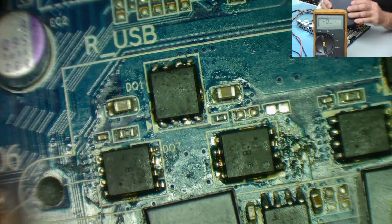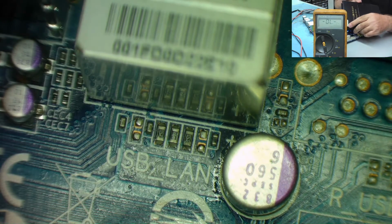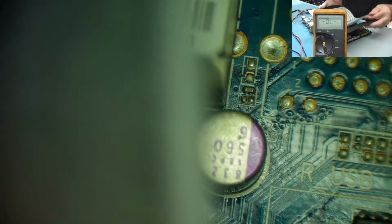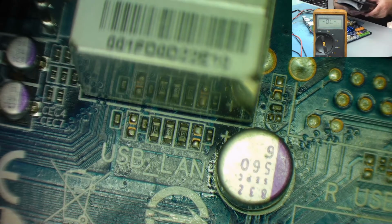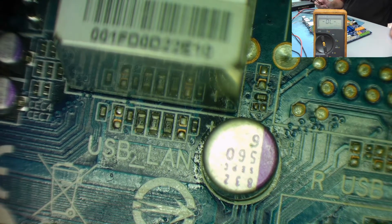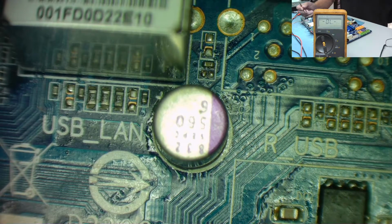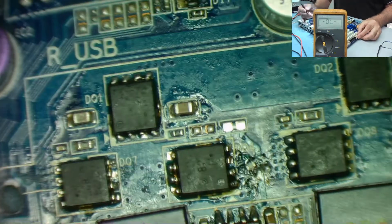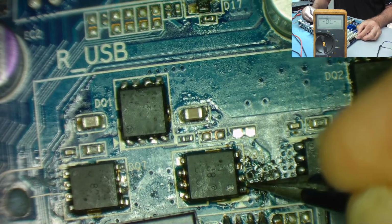Okay, so I have a book of resistors. I get these off AliExpress. It says 0402 as the size, but they can be a bit confusing because you have imperial sizes and metric sizes. 0402 exists in both. In here is lots of different values, a strip of each. Sometimes you're not sure what you're buying, so you get 0402 thinking it's metric and it's imperial, which I think is an 0201 in metric. And this is the next size down, a half. The other one I had was too big. This is the next size I have, and I think these might be too small, but it's what I've got. So there's a resistor.